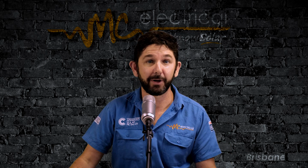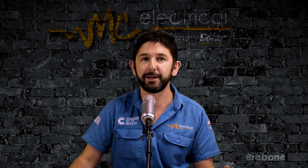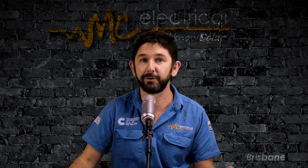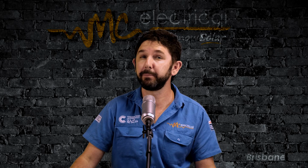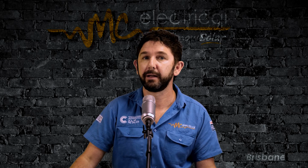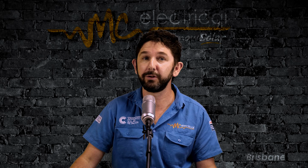So there's my review. In short, SolPlanet is new to Australia. We don't really know if they're going to be here long-term to honour their warranties. It's an inflexible inverter, so not suitable for complicated roofs. At time of recording, it didn't have a consumption monitor. Its maximum power point tracker isn't great, and it doesn't have a global maximum power point tracker, so I wouldn't use it if your panels are going to be anywhere near shade.